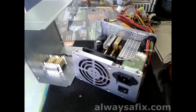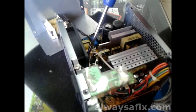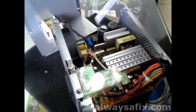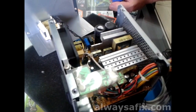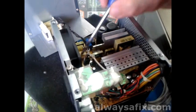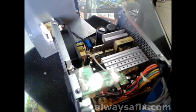Generally working inside these power supplies, there's always a fuse, an inline fuse. If there is nothing else obviously burnt and it's just popped the fuse through a surge, then you can replace the fuse — never bridge it, always replace it with another fuse and see how it goes. If you see something is burnt and it's smelling, don't even bother replacing the fuse.